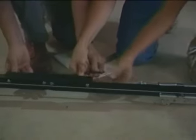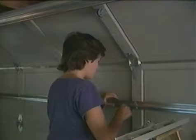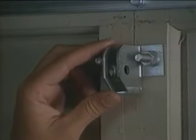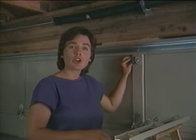After we add the chain drive, we're ready to install the opener. Before we did anything, we checked the balance of the doors and disengaged the locks. Then we found the center point of our door to attach our door bracket. Our door bracket runs even with the top roller, and we used security bolts that run all the way through the door.